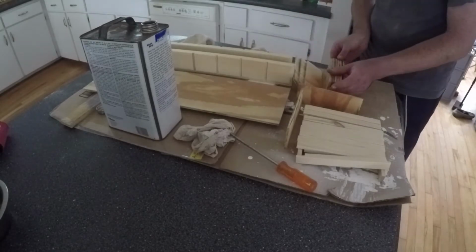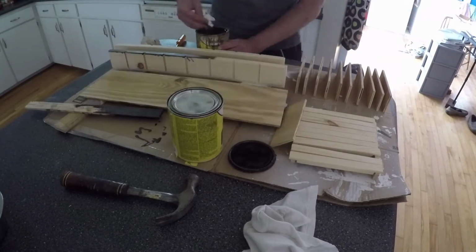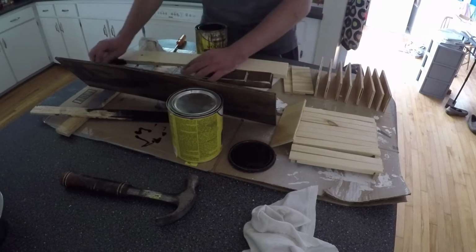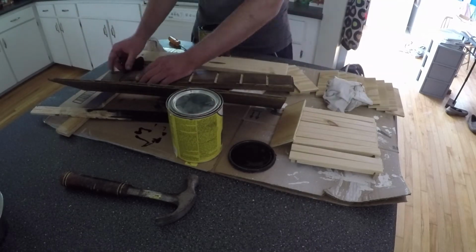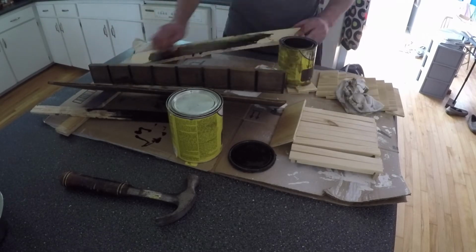So instead what I'll do is I'll release a separate video with the full time lapse of the build, and I'll put a link to that in the description below. The only noteworthy thing about staining that I don't mention in the staining video is that to really get in the corners of some of those nooks and crannies, sometimes it's helpful to take a flat edge screwdriver like you see me using here and really press the staining cloth into those corners to help it get in.